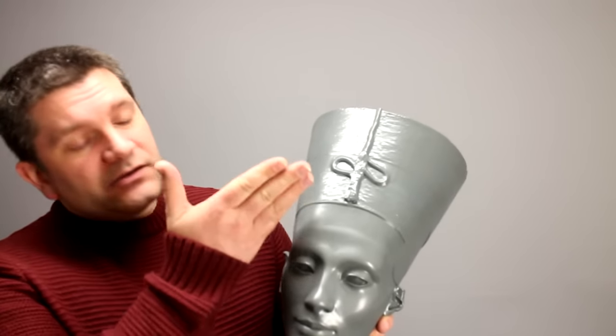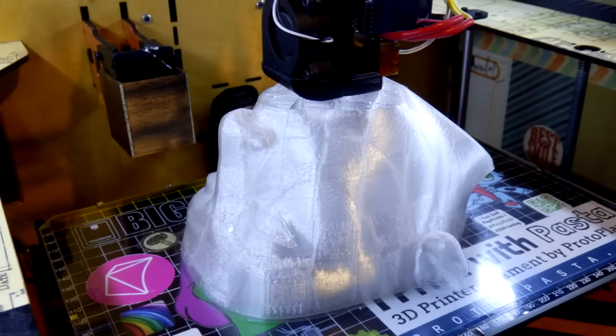Her face — because she has facial features with the nose, eyes and ears — is fairly hard to print on a desktop 3D printer, because you either need to use support material or you need to angle it. So because I had cut the top headdress off, I chopped across her neck, and that gave the angle to print, which was much easier to print the face section. So we've got two sections up top, the face section, and then the lower section from her neck downwards. Those were the four sections I used, and I printed them on the Big Box 3D printer.